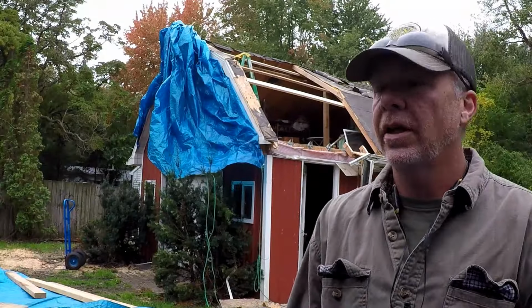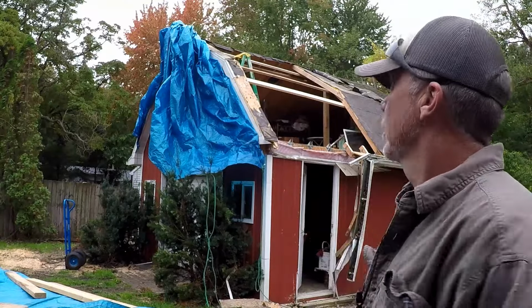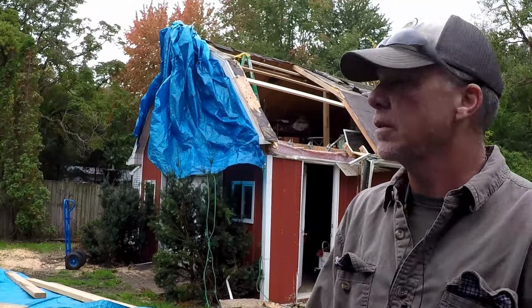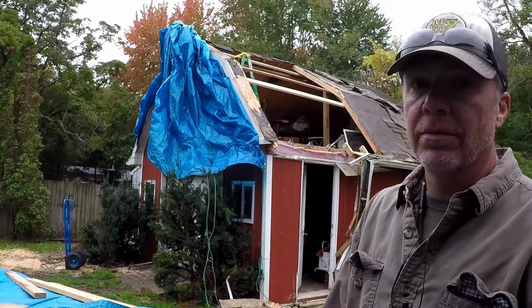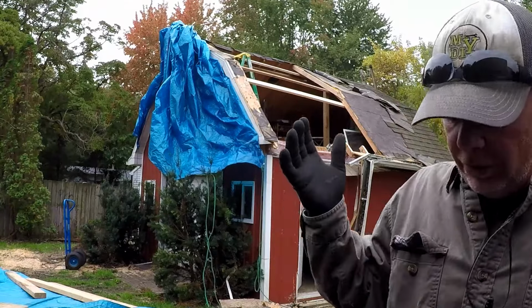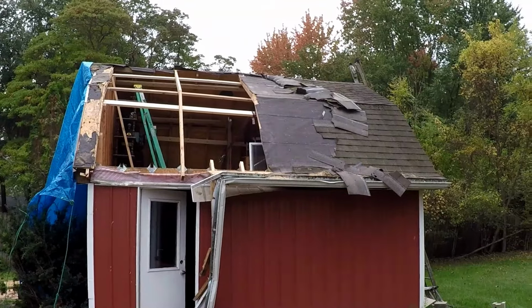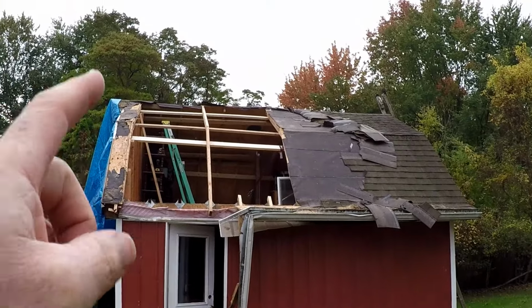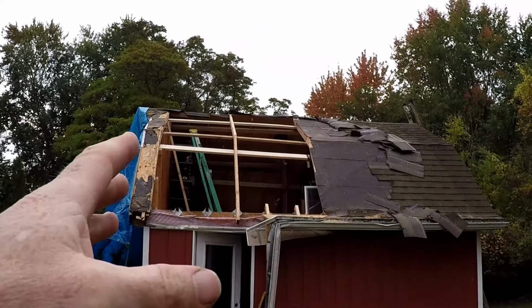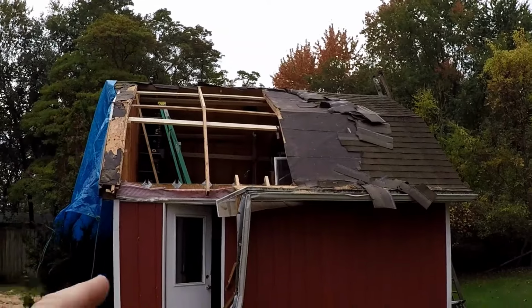Day four, and I have a plan for the first time in 4 days, I think. I'm gonna try to build these rafters in place instead of trying to mock up a half truss and putting it in. I think it should work. Who knows? I spent about the last hour racking my brain why, when I laid out my stringers to put that truss on, it was wonky, it dog-legged.